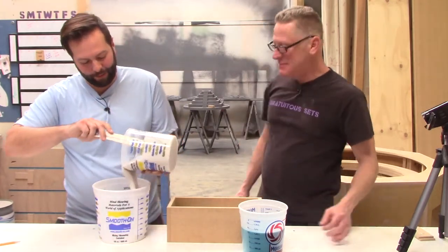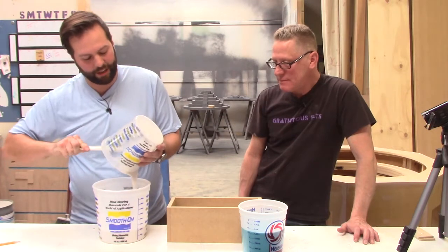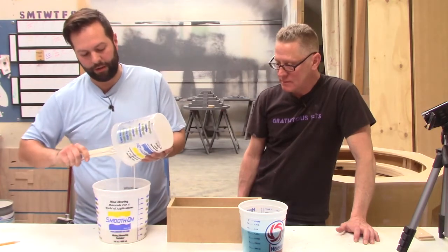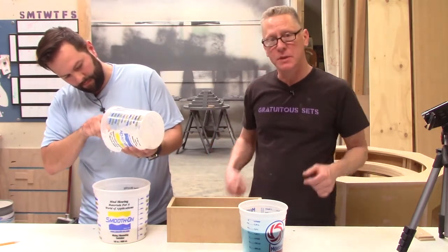I'm going to start pouring our silicone, part A and part B. We're going to mix those together, and we're going to brush on a light layer on our model to make sure we capture all the detail, and then we'll pour the remainder on top. Also a bit of making sure we don't have any bubbles in all these fine little carvings that are in the model itself.